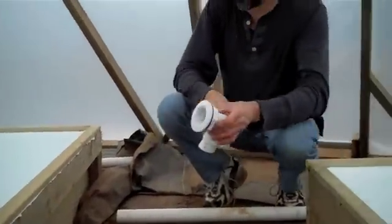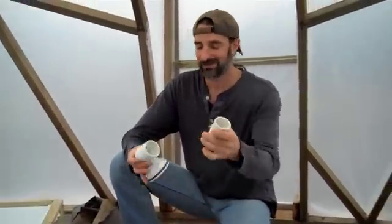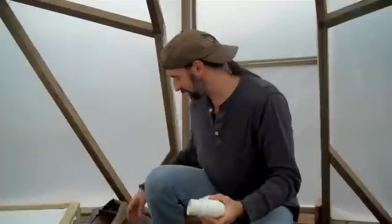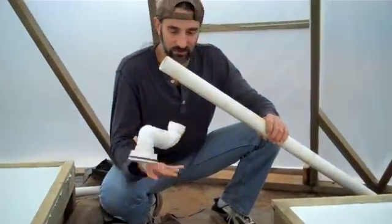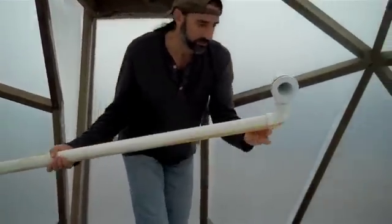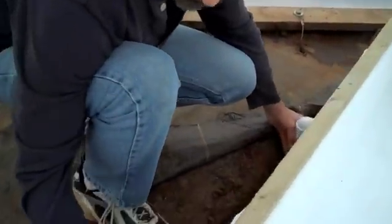So we're going to come through the bulkhead fitting, go straight down, go into the ground. The pieces are: bulkhead fitting, elbow, little joiner. We'll run it back that way - this long piece will run under the ground. We'll connect in there, sweep back up out of the ground, do a 90 back into this bulkhead fitting going through that tank right there. It'll slip just like that.